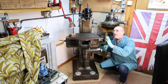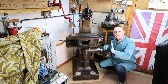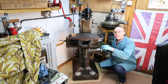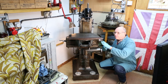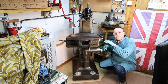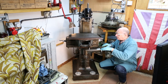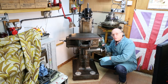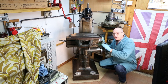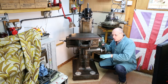Hello everyone. This is my Alexander Master Toolmaker milling machine. Over the last few years I've been rebuilding it and mechanically it's now finished. It still needs painting, but we'll be doing that a little later once I've got it all plumbed in and working. One of the things I need to do to this machine is get it flat and level — level in two planes, so back and forth and also sideways. You normally adjust these machines with feet in each corner that you can crank up and down to get the level correct. This machine hasn't got any feet so I need to fit some.